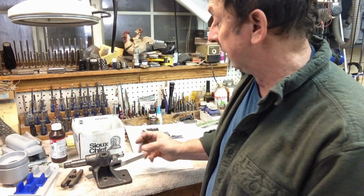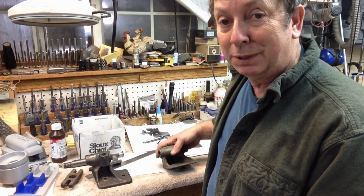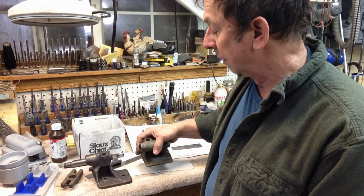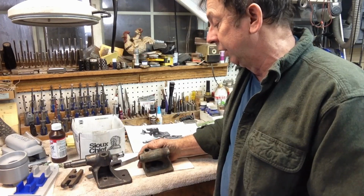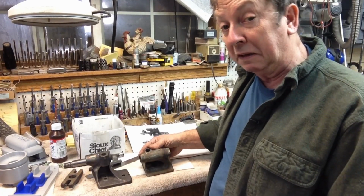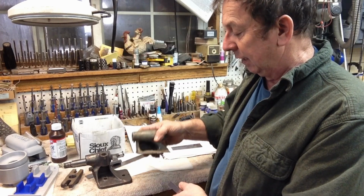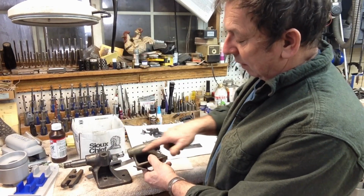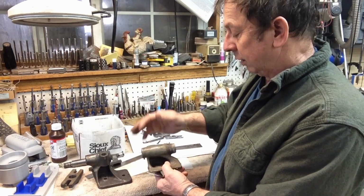Now for the tailstock spindle itself, and people may disagree with me, but it's basically a modified 6-inch lathe tailstock. That's what it is. Some of the parts are interchangeable, and there may be a few dimensional changes in them, and I'll go over what I think I know so far. Now, of course, height is different because it had a 6-inch and had a riser and all that stuff. And it's quite a bit different shaped here. Our lock is on the front for our split cotters.